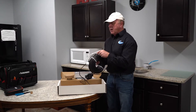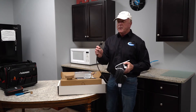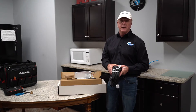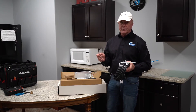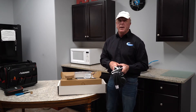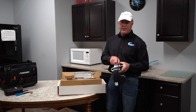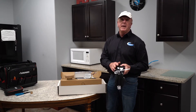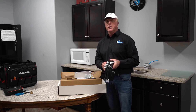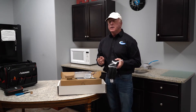Here is your sensor. It comes with both sides. This side would actually go in the equalization tube if you're using one. This side would typically go in the skimmer. If you're building a new pool I would strongly recommend that you run a special conduit to the skimmer and mount this in the skimmer. You could alternatively run a conduit to the side wall of the pool and mount it there. If you have a spillover or infinity edge, you would mount this in the basin — when the basin gets low it turns on the autofill, water goes back to the pool, and once the pool fills it spills over into the basin to turn the sensor off.